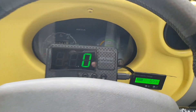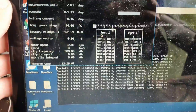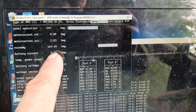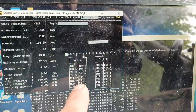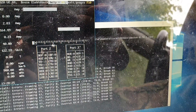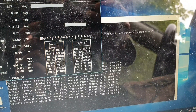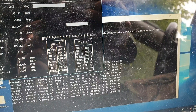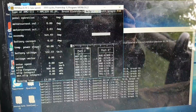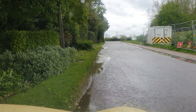We are ready to test the motor in Y. I've done all the wiring up, changed the motor connections, and just going to give it a go. It runs, but it's weird that it's still coming up with that fault code — even though the motor's not overheating, I've literally just pulled out the drive. I don't know what that means. That's an interesting one I'm not quite sure about, but let's see how it runs in Y and see if we end up overheating or not.